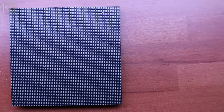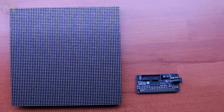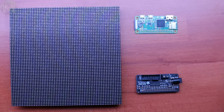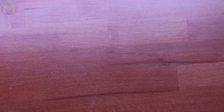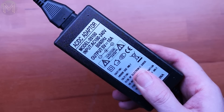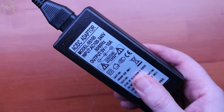This is where Docker comes in. To make this project, you'll need to have an RGB matrix panel. I used a 64x64 LED panel from Adafruit. And because there's a heck of a lot of LEDs, I'd strongly suggest getting one of Adafruit's RGB matrix controller Pi hats. Of course, you'll need a Pi Zero W and an SD card. You can use any Pi for this, but I wanted it to be as compact as possible. You'll also need a pretty hefty 5V power supply — I used a 10A switch mode power supply, which had plenty of juice.